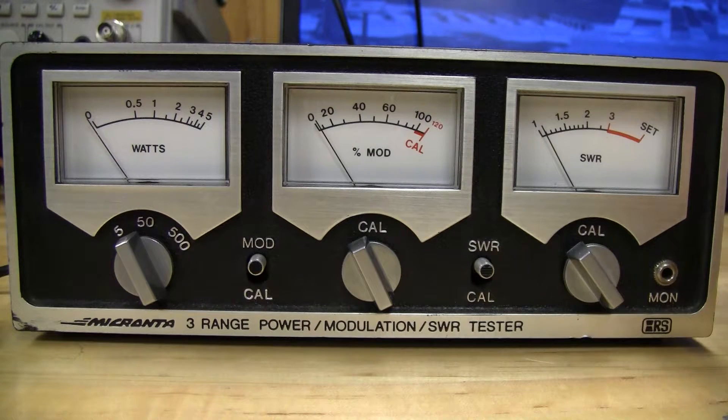What's happening is SWR — standing wave ratio — has to do with power reflected versus forward power, transmitted and reflected. When waves are reflected, they become standing waves on the line. With a simple meter like this, the meter is measuring the total power on the line, which is affected by the standing waves. The forward power is only 4 watts out of this radio, but with that SWR of about 2 we gained a little bit and it was reading 5 watts.